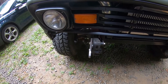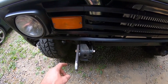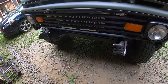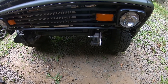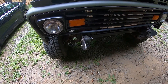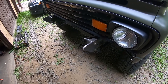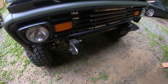This one's bent up and over, but it doesn't really matter. On this side I have some spacers in there, which is going to be fine. The next thing we're going to do is put a piece of 2x4 rectangle tubing across them. Once I do that, the relationship between these two is going to be set in stone, and if they're not perfectly square and level, I'm going to be looking at this thing and be pissed off about it. Just like any project, you're best off spending your time at the foundational level, and then it'll come together the way you want it to.